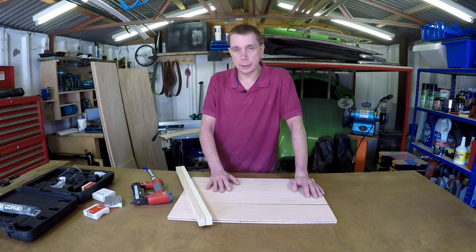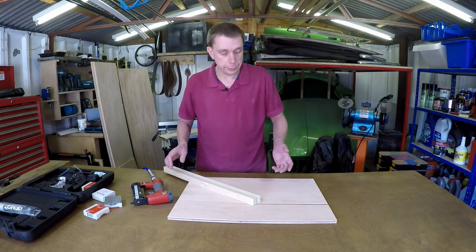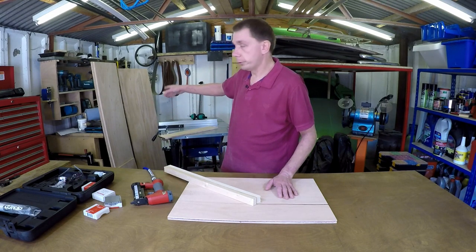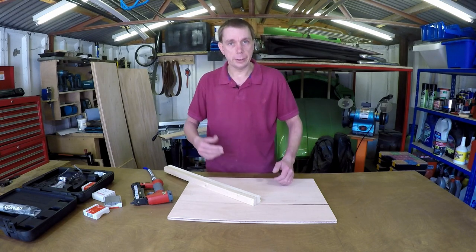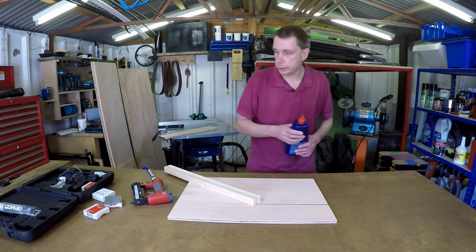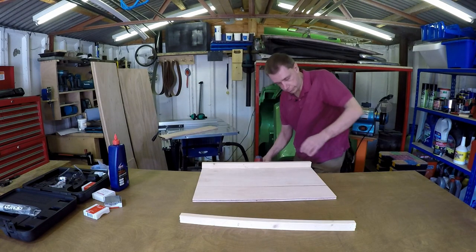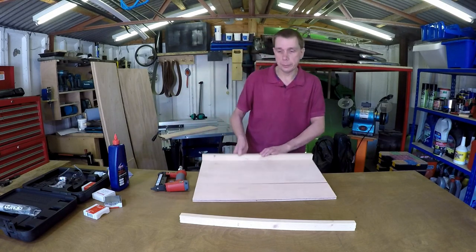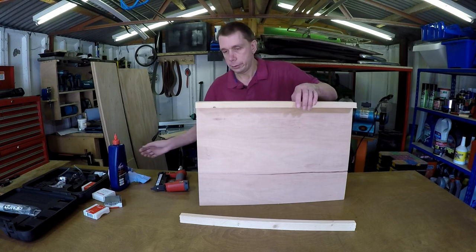So I can do a bit of assembly before I start the big job of cutting all the shelves. The first part is to glue and pin these two plinth rails to the underside of this to give it something to stand on. Then hopefully I can attach one of the sides and the back, and that'll give me three sides of the box, and I can start putting the shelves into that. I've got the nail gun. I need the glue. Yeah, slightly too much glue — however, at least it should stay stuck.